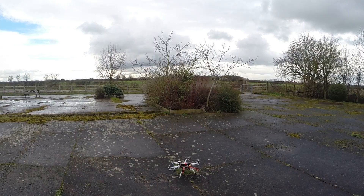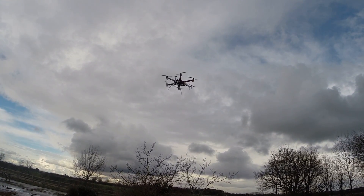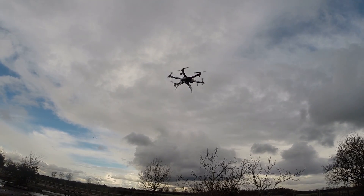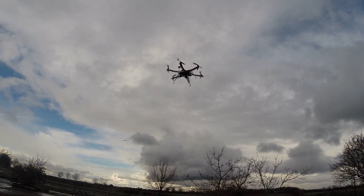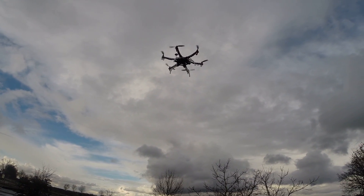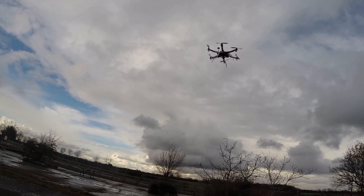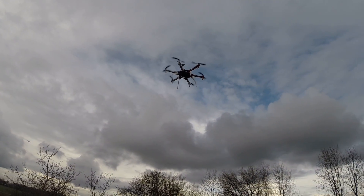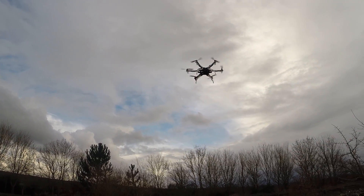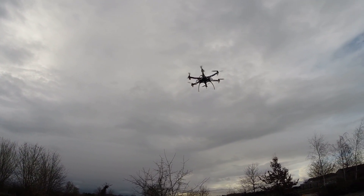And take off. What you can see at the moment is the craft is really very stable — it's holding its GPS position, and that's what I mean by being in loiter mode. So I can step away from it, walk away whatever, and the craft is literally just hanging there in space without any inputs into the controls at all. It's got a GPS lock, it knows its position, and because I'm not changing the throttle settings, it's not changing its altitude either.